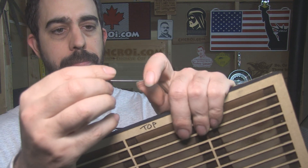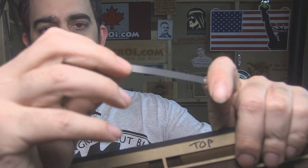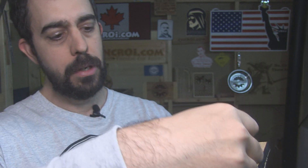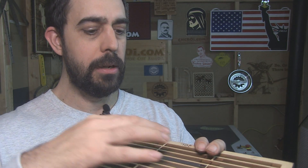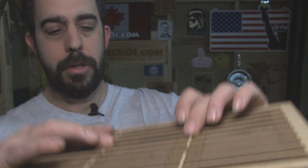In this case, it's for stainless steel cable tags. You'll notice there's a little tab that sticks up and that little tab needs to be downwards. That's why there is a little bit more laser engraving on the edges here, so that when the cable tag goes in, you can see it's actually flush and totally flat, which is pretty cool. That's very important because when we do fiber laser etching on this 304 stainless steel, there's still a little bit of warping on the materials as it heats up. But at least we start off with a very flat surface, and when the etching is happening the etching is even across the whole tag.